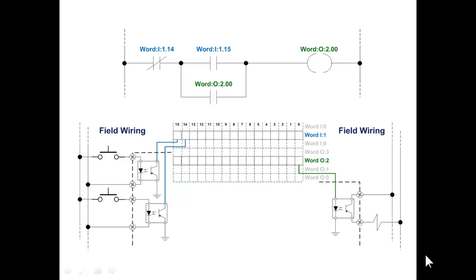Well, we've really enhanced our graphic now. We've expanded it not only to include a rung of relay ladder logic, not a relay circuit. This is not a normally closed contact, normally open contact, but this is a true if off instruction, true if on, and an energized output. And we still have our two inputs, they're push buttons. However, this one is now a normally open. So both of these push buttons are normally open. We also have an output, a solenoid. So this could be a solenoid that operates a cylinder.